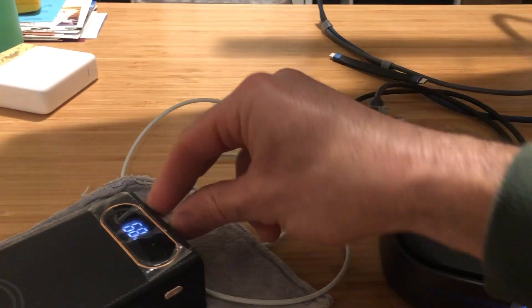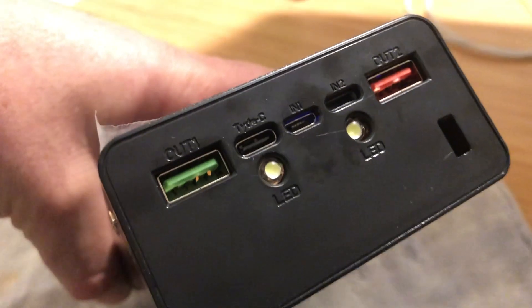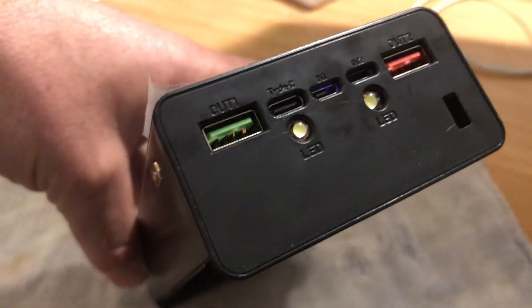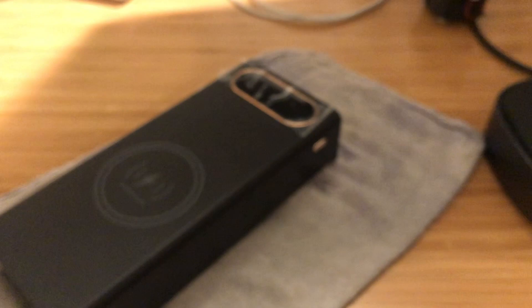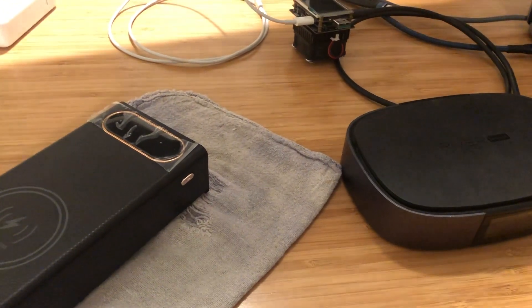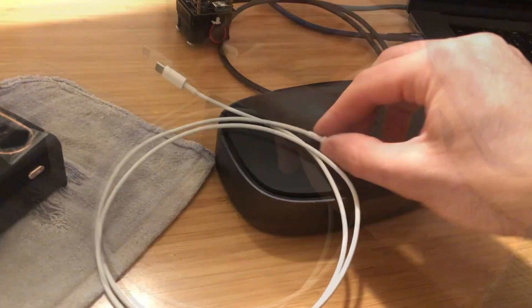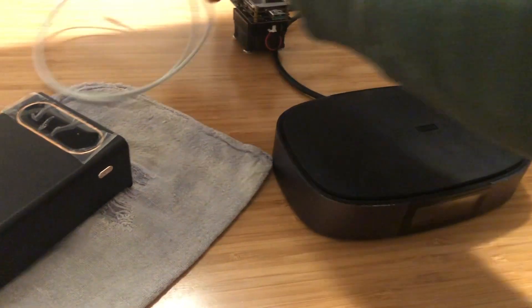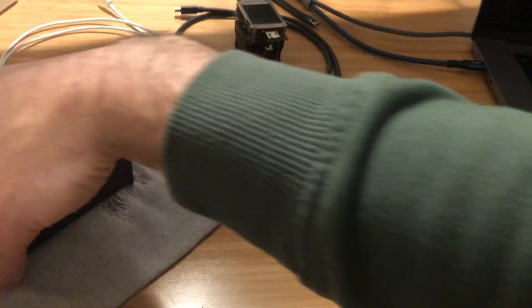In summary, this 18650 DIY power bank can be used in a couple of different ways. The lightning port is capable of input at up to 12 volts power delivery, and it's always an input as lightning is designed. The USB-C port functions as a dual-role port just like on a laptop or other power banks, and power can flow either direction. In my testing, power always flows out of the 18650 power bank to another dual-role USB-C port. If you want to force power into the 18650 power bank, the trick is to use a USB-C to lightning cable — the non-dual-role lightning plug forces power to flow in. Hopefully that was helpful to those curious about how power delivery works at what levels. Thanks for watching.